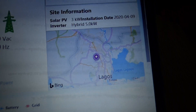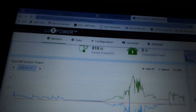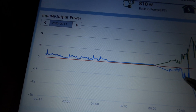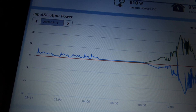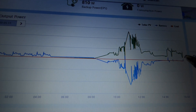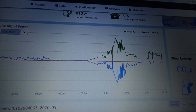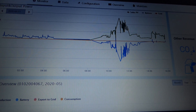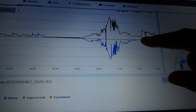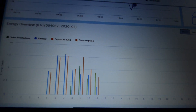The dashboard shows the location of the installation — it's in Lagos, Nigeria — and then it shows what's happened today. We ran on batteries all the way through the early hours, then started charging the batteries as solar production grew. When the graph is negative, it means you're charging the batteries; when it's on the positive side, it means you're discharging — meaning what you're producing is less than what you're consuming, or vice versa.